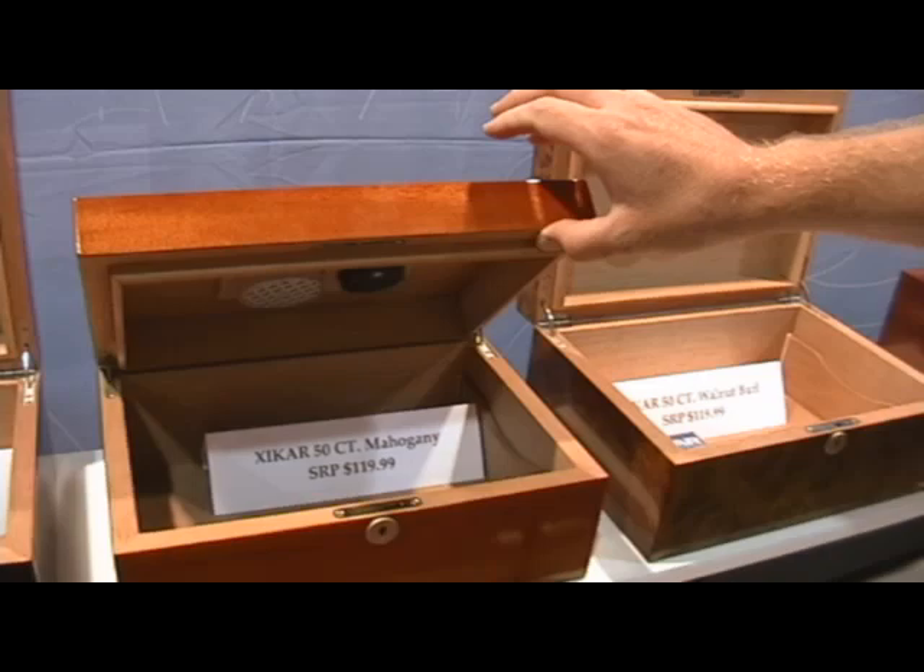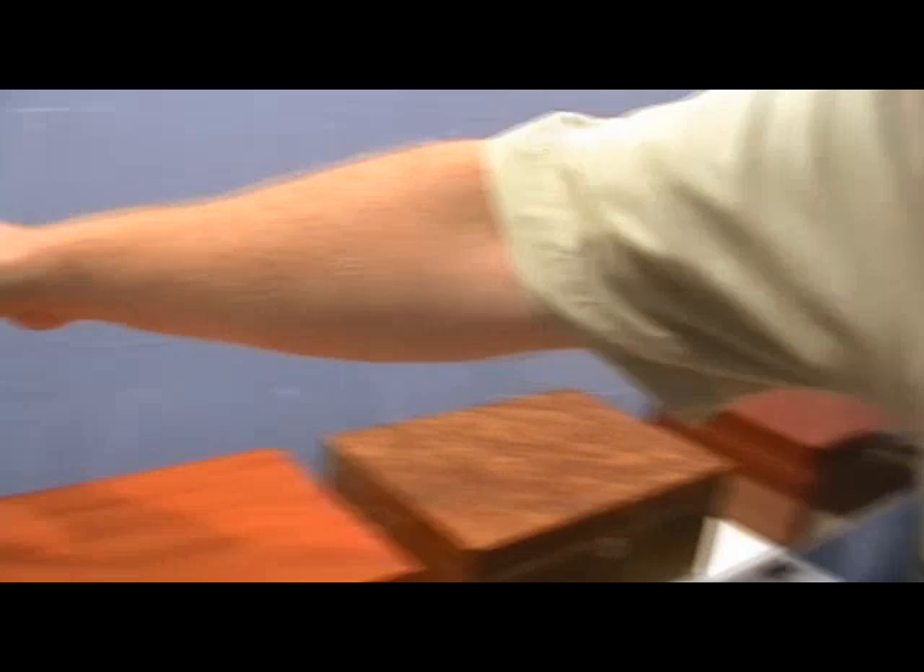Is there truth that you want the box to make a whoosh when it closes? When you drop the lid, it should never slam — it should catch on the air that's in there and then close more slowly, which is exactly what these do. As you can see, they drop on a cushion of air, and that's accomplished by installing a seal correctly.